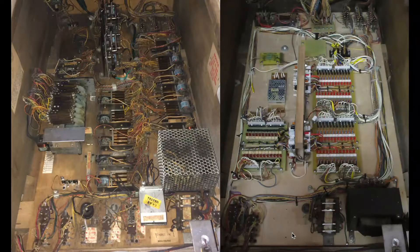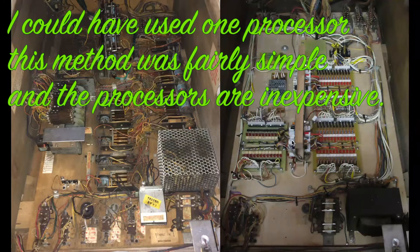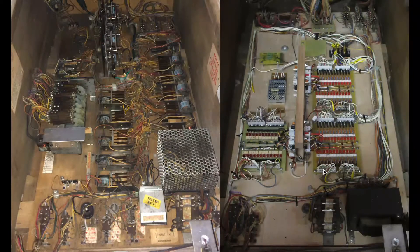Here are the two logic boards side by side. On the left side, we've got the electromechanical board with all the relays and their contacts, the motor cam assembly and its contacts, and two stepper units. Here are my inputs that go into their own processor where the signal is conditioned and filtered and then is communicated through a serial connection to the main processor board. The logic is really done in the main processor board. Here are my outputs. These use the same pinouts and connectors for the cables to the play field and cables to the head of the pinball machine. Essentially, you can replace one board for the other very easily.